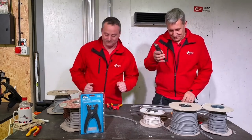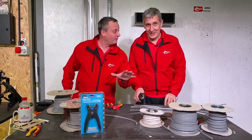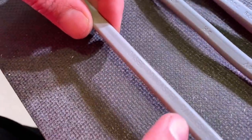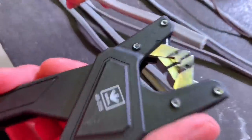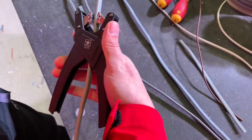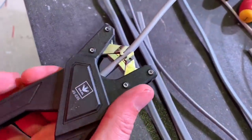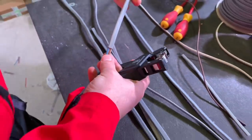Let's start with 2.5mm and test it on a known cable — our Doncaster Cables twin and earth that we use a lot. Here's our Ideal stripper. See that mechanism there — we like the mechanism. Bring the cable in; you can see you can go all the way through the body of the stripper, so if you need to strip back a lot — say you're doing something in a consumer unit — you can keep pushing. It's quite satisfying, nice and easy. Then go back in for the conductors and it strips both of them at once. I like it.